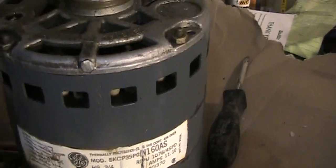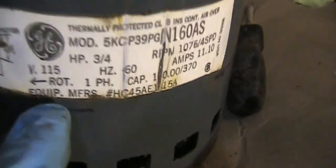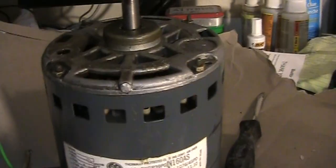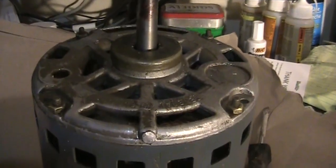And also, before when you test this motor, you should pay attention to the rotation to make sure it rotates exactly like your label. So if your rotation is wrong, then you are not going to install it. When you really put the power to the wire, that is how you do the pre-testing.